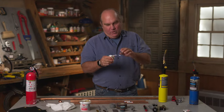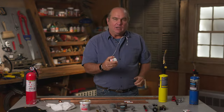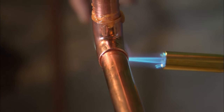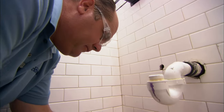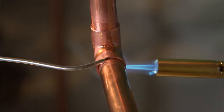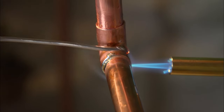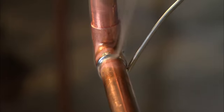Unwind about 8 to 10 inches of solder from the spool and make a hook. Light the propane torch and put the tip of the flame against the middle of the fitting. Hold it there for 4 or 5 seconds and wait for the flux to bubble. Move the torch as needed to distribute heat evenly. Touch the solder to the opposite side of the pipe to see if it melts — if not, heat a little longer. If it melts, press the solder into the joint until the hook completely disappears.